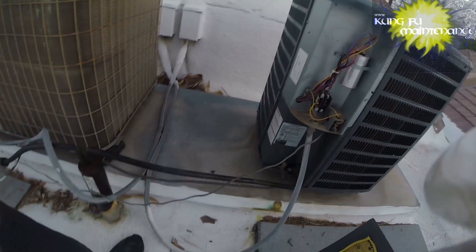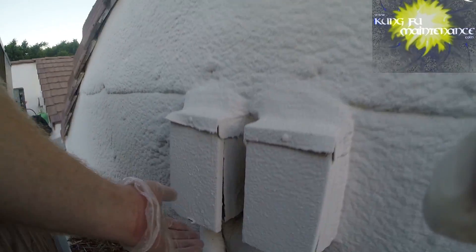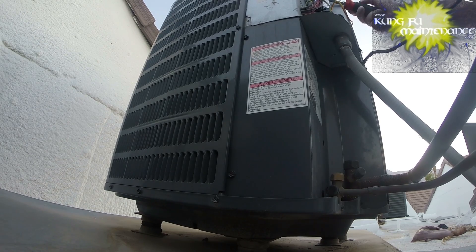And this one's for you, my friend. Here we go. Pull the disconnect and we'll discharge the capacitor. That capacitor holds the charge even after the power is disconnected. So I'm going to bridge the leads. There we go. Here's the common, here's the start. Sorry for the poor camera positioning on this one — you guys have seen me do this a lot of times though. I still felt it was valuable enough to show in the video.